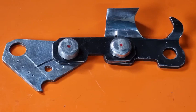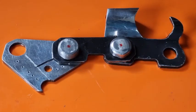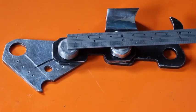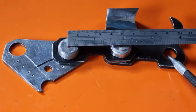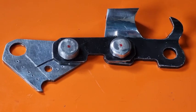Now if you don't have any of those and you just want to find out what the pitch of the chain is, the way it's arrived at is: you select any three rivets — it doesn't matter what order they are, you just count one, two, three — then you measure in the middle of the first rivet and you measure with the ruler right in the middle of the last rivet, then divide it by two. That is your pitch, whether you use imperial or metric.